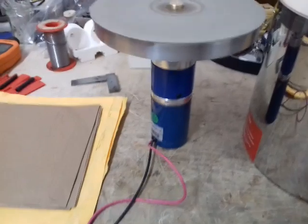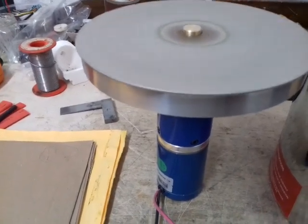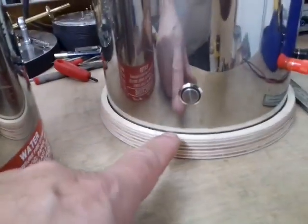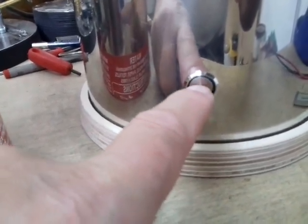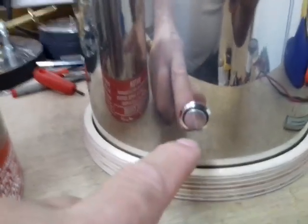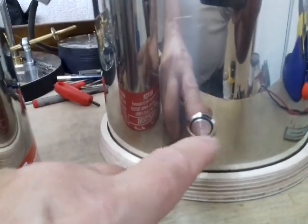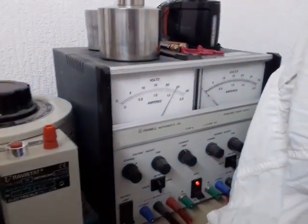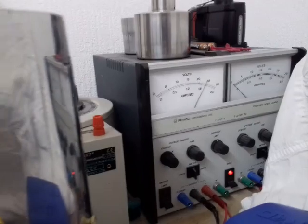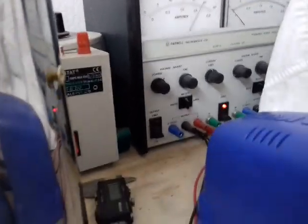The aim of the game is to make savings, not profits. I'll be able to sharpen all my woodwork chisels and engraving tools on this one with relative ease. I've got another plywood base to make, or I might just swap them over when I'm using it. The switch on here I'm not going to use, for the same reason — when you stop the machine it stops too abruptly because of the gearbox and it could end up doing long-term damage. So I'm just going to put a warning light in there, like a neon, to let you know that it's on and the power's on. Running on 24 volts it's impossible to get an electric shock that's going to harm you — I think anything up to about 50 volts you're still relatively safe, and at 24 volts you'd never get electrocuted.